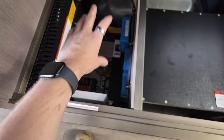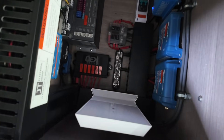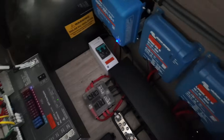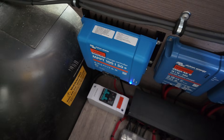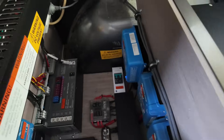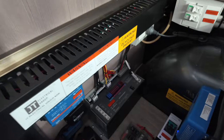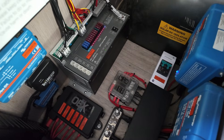Walk into the back and this is where all the magic is. There used to be battery boxes here, and a DC charger. What we've done is a full retrofit of the system. You've got the Starlink Gen 2 modem running in here, twin 50-amp DC chargers, a 50-amp solar controller looking after the 600 watts of solar, a solar circuit breaker — that's a double pole to comply with AS 3001 installation laws. All panels on the roof are also fused to comply. We've got our label kit and main fuse panel.